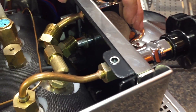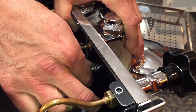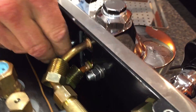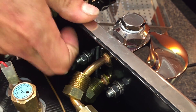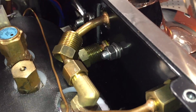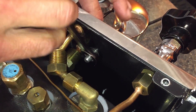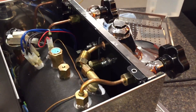Put on the flat washer first, then the lock washer. You're holding the group in front so it doesn't fall down. Snug the nut by hand — don't crank it at this point, that'll just hold the group in place. Then flat washer, lock washer, and nut on the other side. Now tighten these up. Hand tighten as far as you can. Just snug them — then do the other side. Do it evenly so you don't do any damage to the face plate. You don't have to snug the hell out of these; just snug them up real good, firm but not crazy hard.